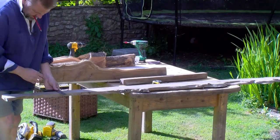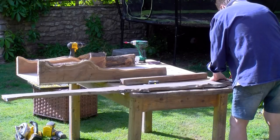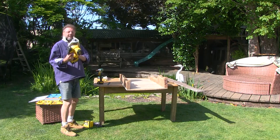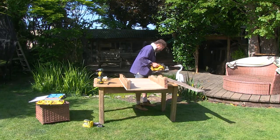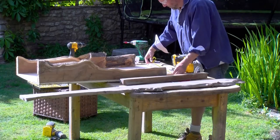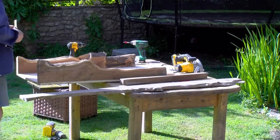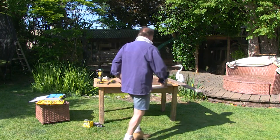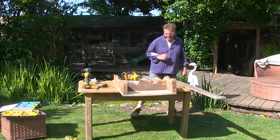50 centimeters. It's worth cutting your first one and then measuring from where that cut is, because whatever you cut with has a blade width — only a couple of millimeters, but it can make a difference. That's interesting — this one is a little bit short. I measured that. Measure twice, cut once. That is 50 centimeters and that is 51. That sucks. So obviously my piece of plywood is not level because it fits there. So we're going to have a slightly wonky thing here.